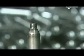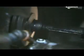As the diameter of the neck narrows, the tube takes the shape of a bottle. Now, each cartridge goes on a lathe. A cutting tool plunge cuts the neck to shorten it. Then it carves out a lip.